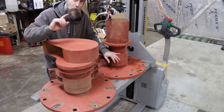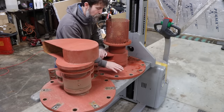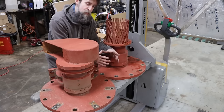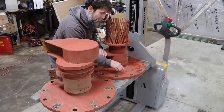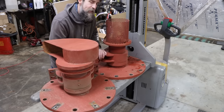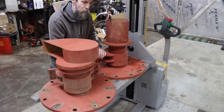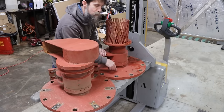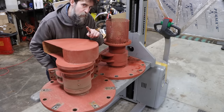I also need to put a large hole in here, either 2-inch NPT or make a custom flange with a gasket. So drill through this, either tap it for a 2-inch NPT bung, or make a custom gasketed flange, so this thing can be drained of its chemical or solvent, whatever they're going to put in here, so it can be drained fully without having to remove these end caps to do so.